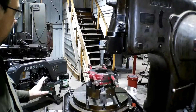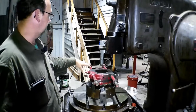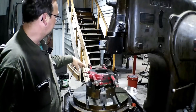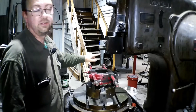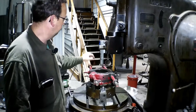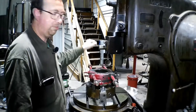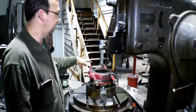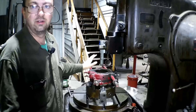The first thing we need to do - and I already checked this - is confirm tool depth. This is set up from a recent job that was only an inch and a half deep. This tool is good for five inches. We're only going four and a half, so we should be okay. We check our depth, check where we're set and make sure we're not going to bottom out. So let's do that.